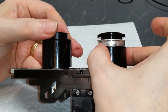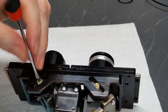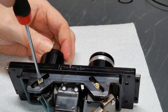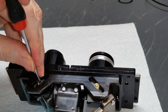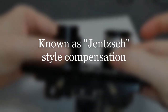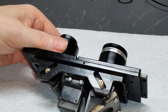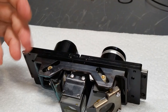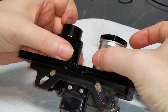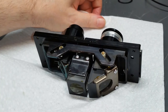What this automatically compensated design does: as you slide the tubes further apart, it pulls the tube in to keep the optical path the same distance, so you don't have variations in tube length as you spread this thing to adjust for your eyes. Now let's go ahead and put the second follower in — it goes in exactly the same way, just drop it in there, don't force it, just try to get the threads to engage. And there it goes. Now as I operate this, you'll see both tubes move together in unison. The earlier or cheaper heads, like on the CH and CH2, just let the tube length vary as you spread — keeps the design cheap, and for an educational scope with low-grade objectives it's probably not a big deal. But this is a pretty nice design.